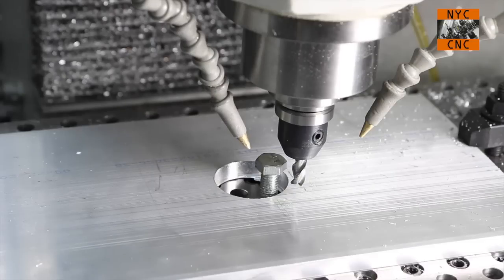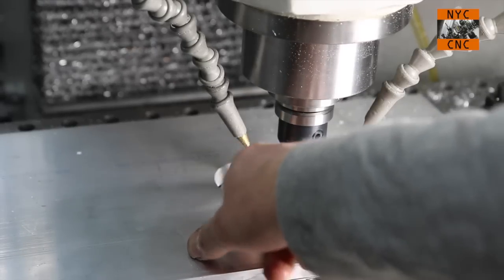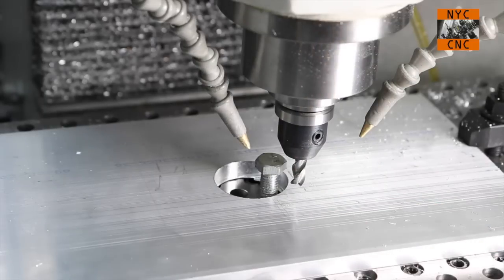Based on how this center circle machined, I think it's going to be fine. If I hear any chatter or I'm not comfortable with it, I'll machine a little clamp that will work back here and loop through that bolt hole there, and that way we don't interfere with our cutting path. But I don't think it's worth the hassle based on, again, how that last piece cut.